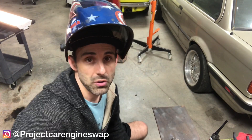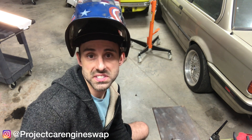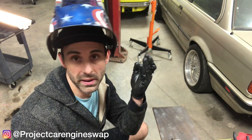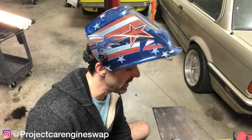This is going to get done pretty quickly. The beauty with TIG — if you can get your hands on a good TIG welder with AC and DC — AC is for aluminum and DC is for most steels like stainless steel or mild steel. The good thing is that you can stick with the same gas, the same tip, and all you've got to do is replace the filler metal, which is pretty easy. You can go from aluminum to steel in a matter of seconds. It's pretty handy.